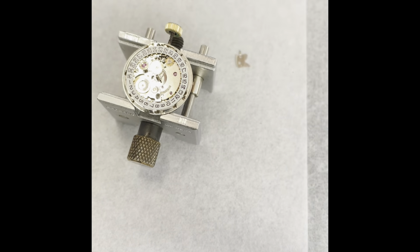So tighten this underneath the microscope because I don't want to break any pivots. I'm also going to oil it under the microscope because they're very small bushings in this. There we go, our reverser wheels have been oiled up. To be corrected, there are actually jewels in these reverser wheels. Hard to see and extremely small, but they're in here. Impressive stuff. Very nice movement indeed. I don't think I have a jewel count stamped here anywhere, but it's more than 17 jewels, I can guarantee you that.